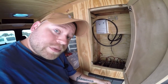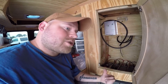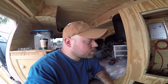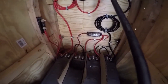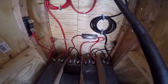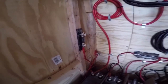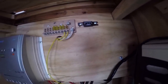I still have a few more things to do — I need to hook up the solar officially into the charge controller and then down into the battery bank. I also want to hardwire in my speed charger for those times where it's raining five days in a row with no sun, so I can just crank on the generator and pop on the speed charger to automatically charge the batteries. I've got all my 100-amp fuses installed — for every two batteries you need its own 100-amp fuse. I've got one there, one there, and two extra spare fuses handy.